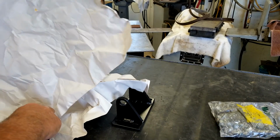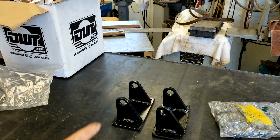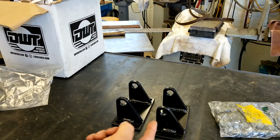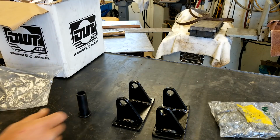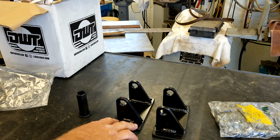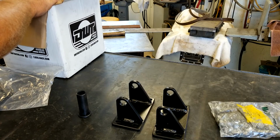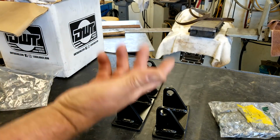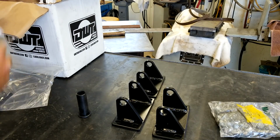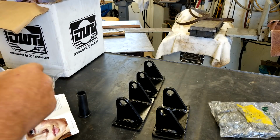My criteria was, I wanted it built out of 3/16. I wanted a 3/4 inch pin. I wanted a 3-inch pin setback. And I wanted adjustable slotted holes. So, nothing like that actually exists. So I made them myself. And I thought I'd dress them up a little bit. I spray painted them, but I kind of wanted them powder coated to match the gate.